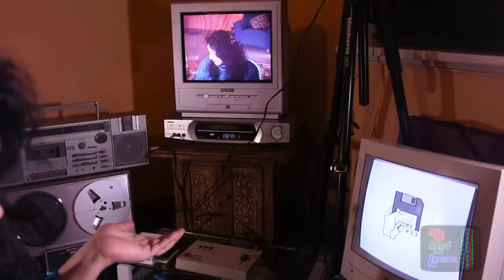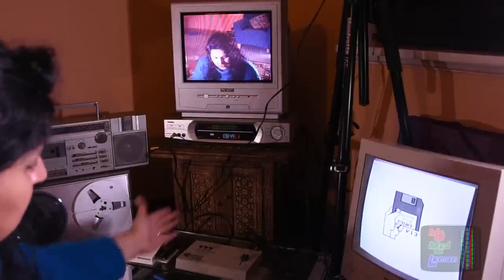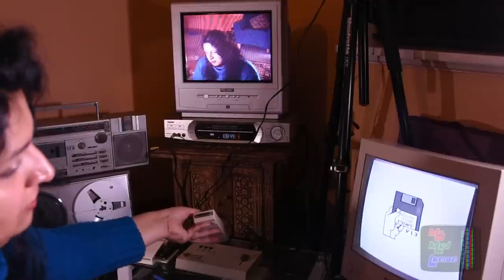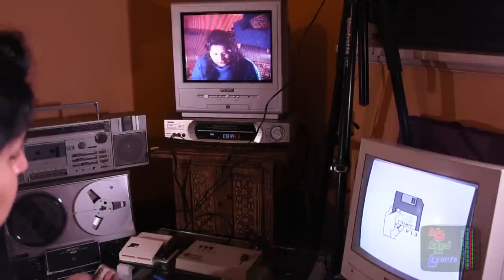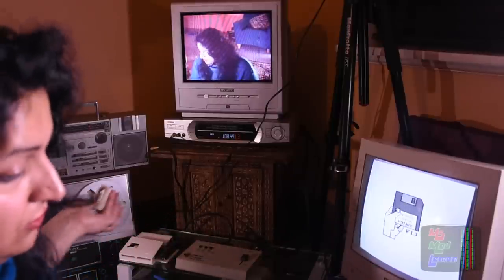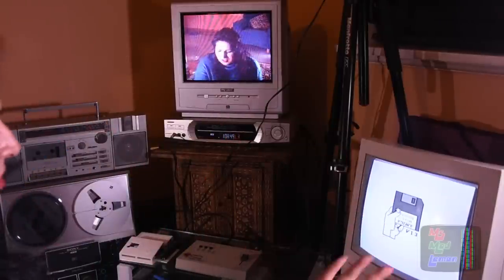On the Amiga 500 you have to have the modulator, which I did try to connect this through, because obviously the feed needs the RGB. But it kept coming out monochrome from there, however when I connected it there, it was color. So clearly the color is getting lost between there and there, whether it's the chroma being connected or not, I don't know. Anyway, I want to just get over this. This is the main thing. This is just the monitor.